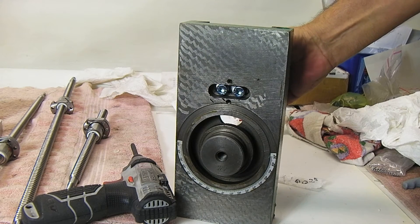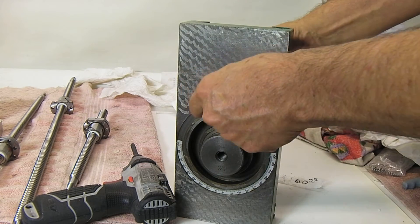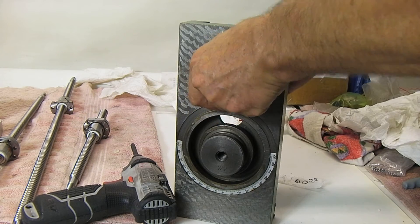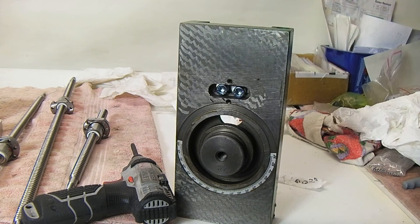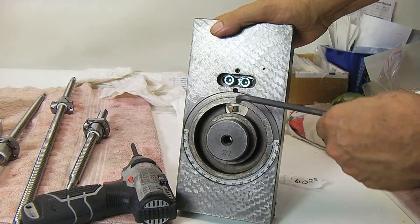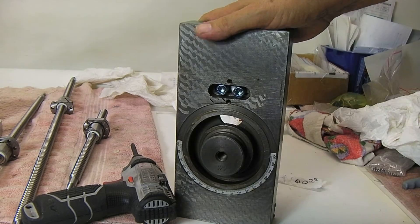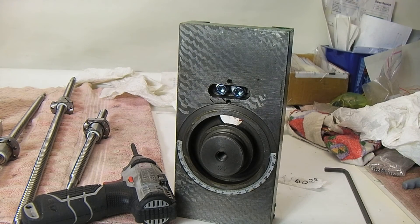It should take just a little bit of force to move back and forth — you want it to be able to tip so you can set your screw. Maybe go just a touch tighter, then slide the screw up and down and measure with an indicator for squareness. The main thing on the 704Z is to take these two allen set screws out first so you can properly set up your Z slide screw.